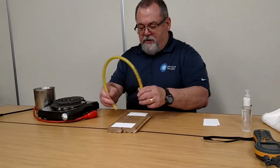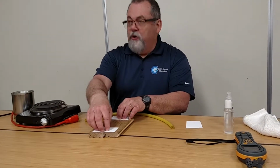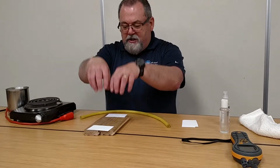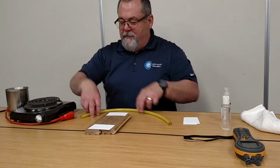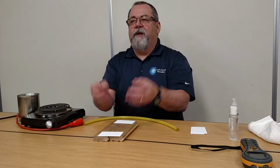So with all these panels hooked together, going out to your truck mount, if you want to think about it, it's kind of like a super hickey machine. If I suck on these panels, I'm creating low pressure. And to have airflow, you have to have 2 openings. So that's why the panels aren't edge to edge. Air is being pulled in where there's no panels to the panels, and any water underneath is coming out, going to your truck mount. So once you're sure you got all the water out that might be under the wood floor, now we're going to set this up.